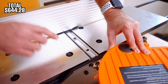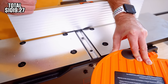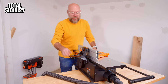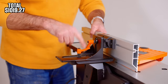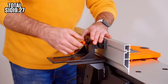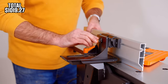If you ever have the option of jointer blades or a spiral head, always go with the spiral head — you'll get a much cleaner cut and it'll be much quieter. This doesn't have nearly the amount of cutters as my Rikon, but this was $374.99 compared to a multi-thousand dollar jointer. The only real complaint is the cheap knobs on the fence. The knobs also interfere with each other. They work — they just feel cheap. That is all.